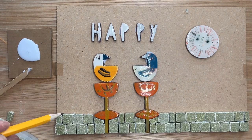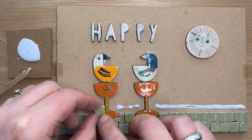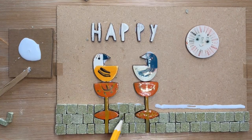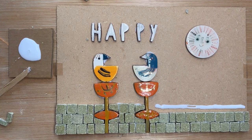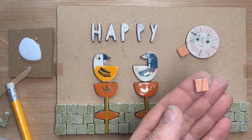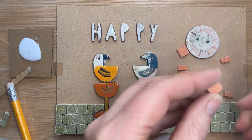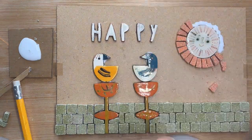Keep the offset pattern going with the row above and below where you have to introduce halves or thirds of tiles. To ensure the rays of the sun sit tightly together, cut your whole tile at a slight angle. Placing these together eliminates any gaps.